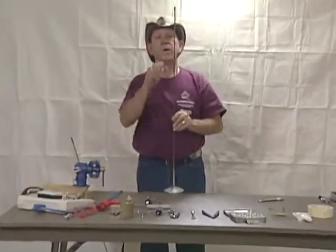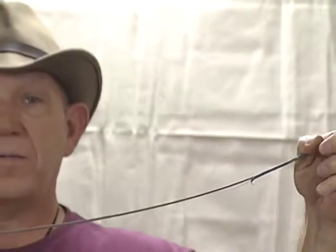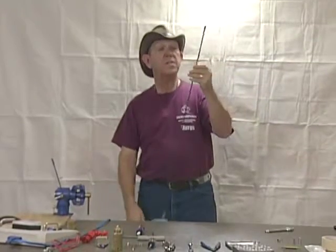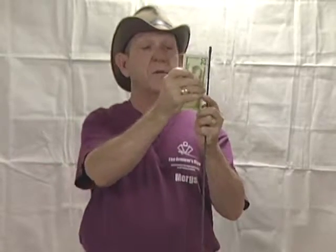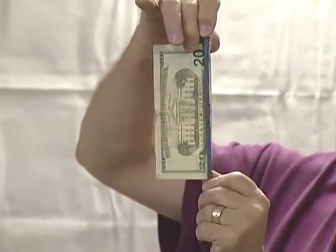Check the condition of the tape on the end of the foil. When fencing, if you make contact between the blade and the lame it could give you a block point and not register. Make sure the tape is in good shape at all times. The distance of tape from the bottom of the barrel to the bottom of the tape must be 15 centimeters. A handy measuring tool is standard U.S. currency, which is 6 inches — approximately 15 centimeters.